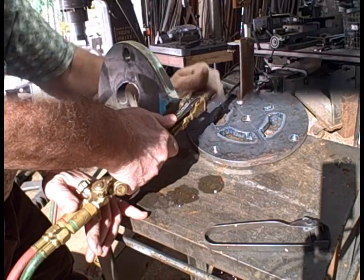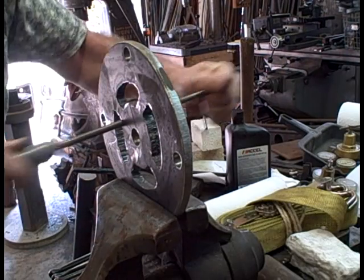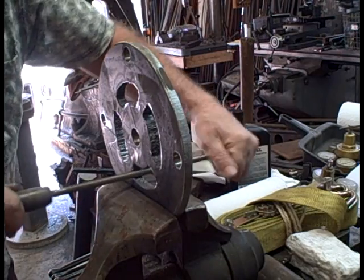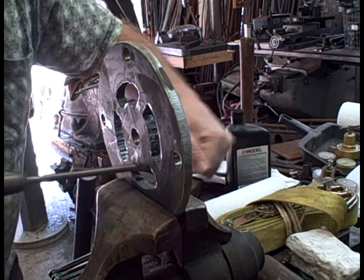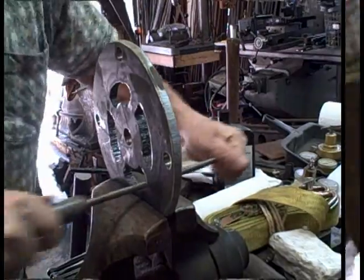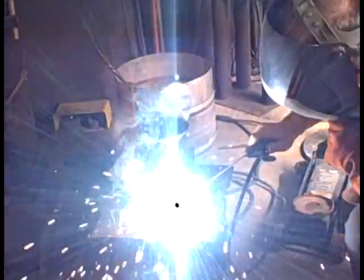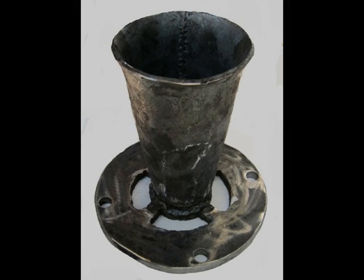I file this not because it needs to be smooth, but to make sure all the slag and anything loose is gone. It would be devastating to a hammer if something fell down into the top of the ram area. Weld the cone onto the base — and there we are, the final product. Good project. Might have to tweak it a little bit, but thanks for watching.